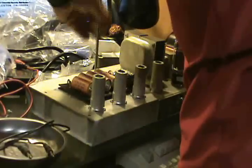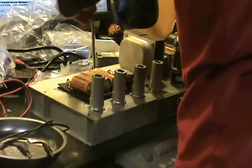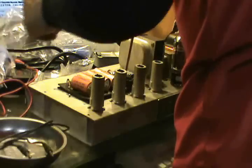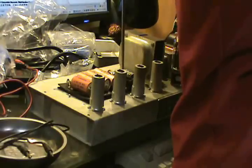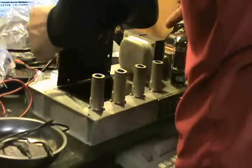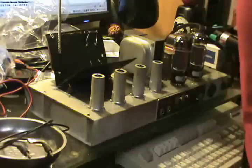The caps are held on a plate made of 2 sheets of fiberboard phenolic. 2 Phillips screws secure those fiberboard sheets. You will need to remove them and lift the top sheet, exposing its underside. The caps are hardwired into the circuit using steel bus wire. I generally will place a screwdriver across each of them for a second to ensure that they are indeed discharged.